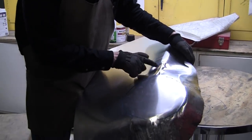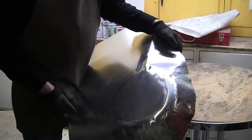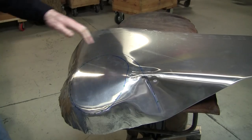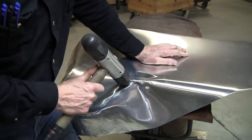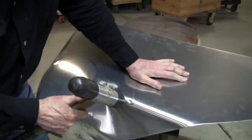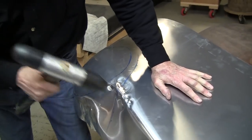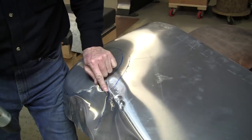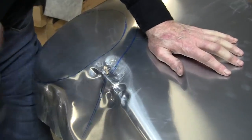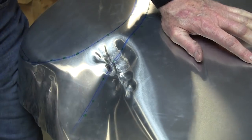And now we'll go back to that bag and try to do a captured shrink right here. Now I think it'll be a little more favorable to capture that. Let's see what happens. Yeah, so we're getting that nice spine, nice resistance. Whenever you see that spine, that is shrinking. Now if you go too far, shrinking becomes stretching.